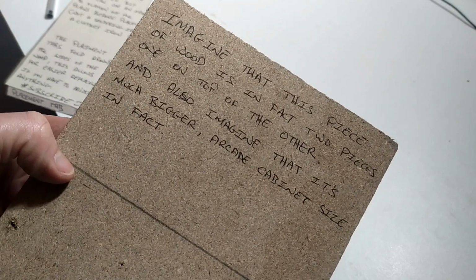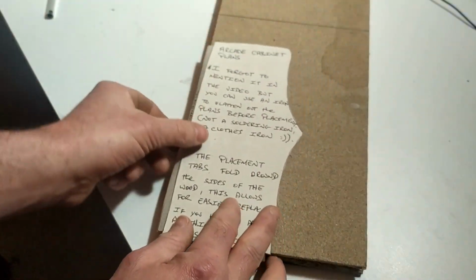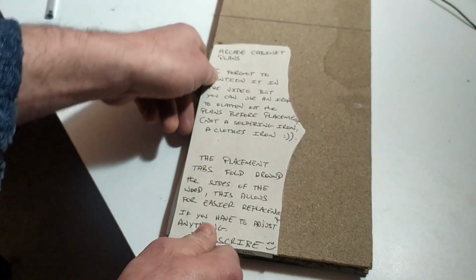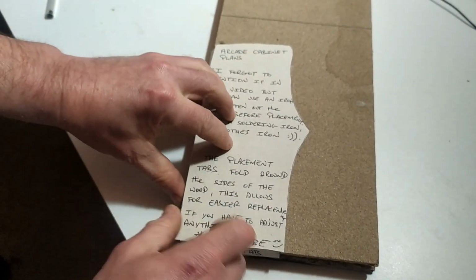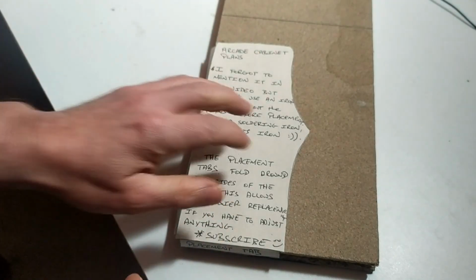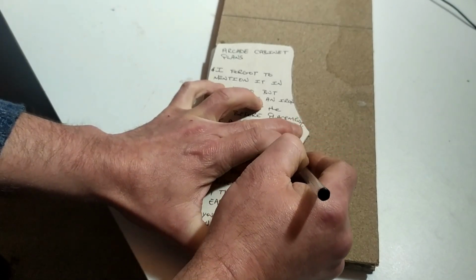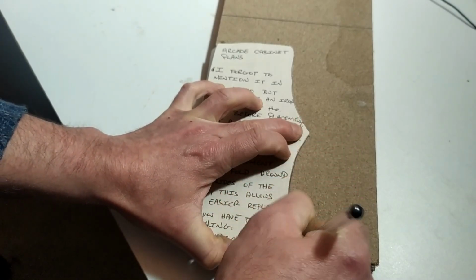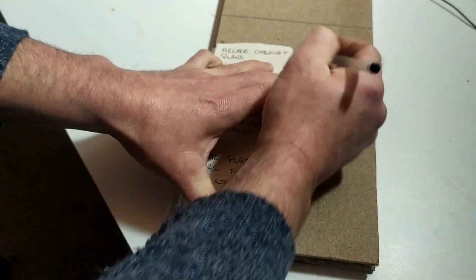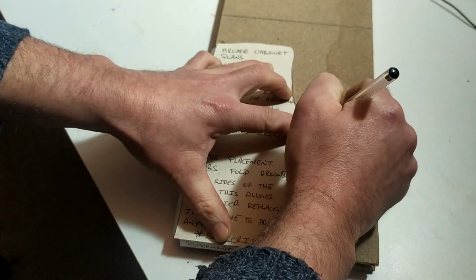So what I did was I put 1 sheet on top of the other, laid down on the ground nicely, and I laid these wallpapery plans on top. Now this wallpaper I used, and this is genius. The cheaper the wallpaper you buy, the thicker it is. That's something that I discovered. Expensive wallpaper is really thin and cheap wallpaper is really thick. And when you're doing pattern making or anything like that, thick wallpaper is what you want because it can survive manipulation.